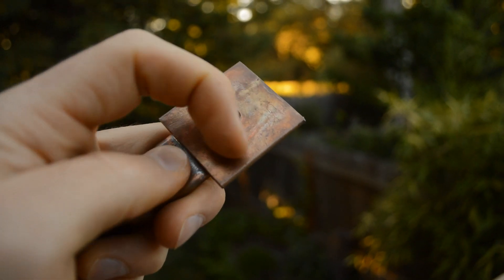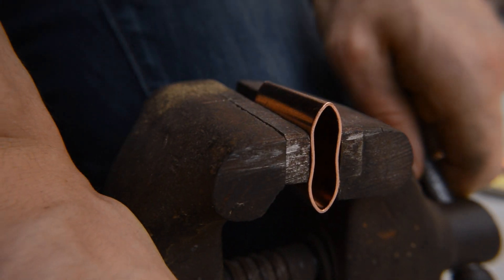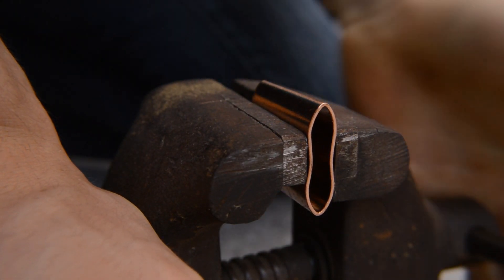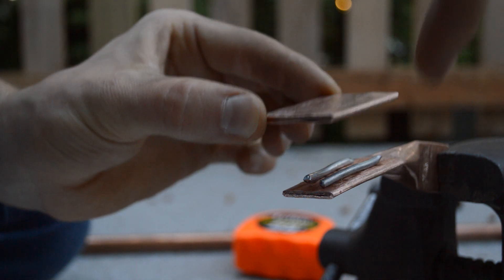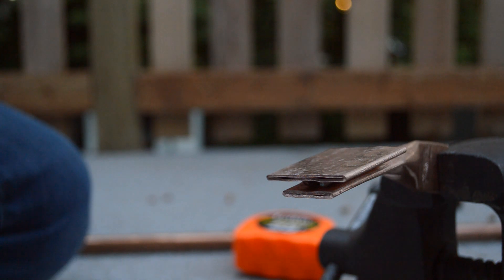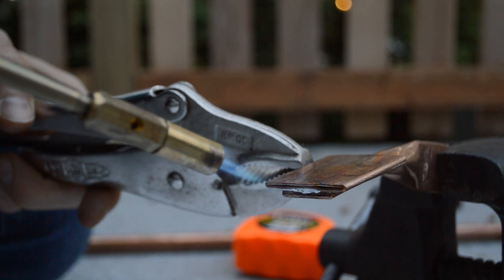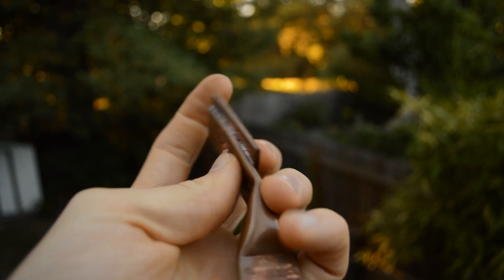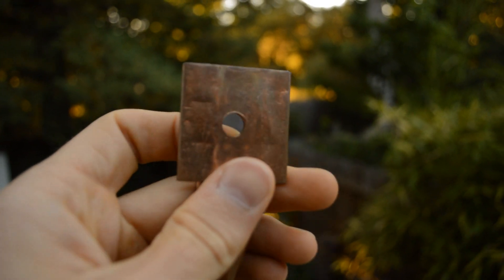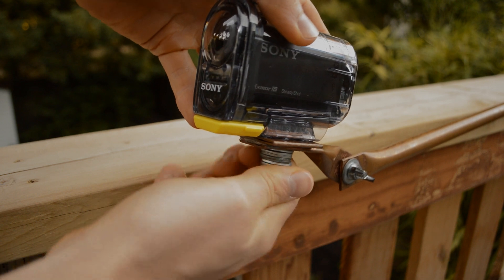Take your 3/4 inch piece — just over an inch long — and crush it down into a flat pancake. Then rest a couple rods of solder on top of your half inch tubing, place the 3/4 inch piece on top, and solder them together with the torch. Make sure you prep the surfaces first and use some flux in the process. Then drill a hole with about a 5/16 inch drill bit, throw a bolt through it, and your camera sits on top quite happily.